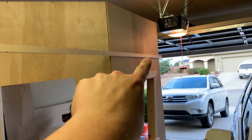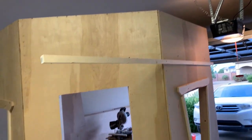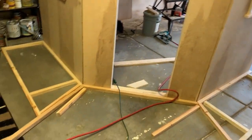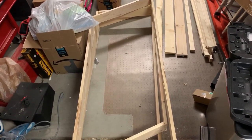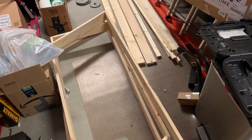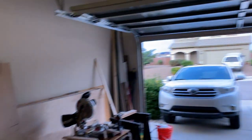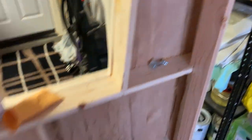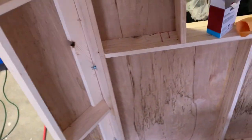So that's the height that the roof deck is going to be at. My second story actually starts here, and then in the middle it's going to be four feet up from there — so a total of 12 feet — but this is about six foot six right here, just tall enough for me to walk under, and most adults. Here are the sections of the second story roof deck or balcony deck that I've mocked up. I'm making everything modular, so you can see my bolt holes where they're going to go in, and on the back side I have bracing. I'm going to use a two and a half inch bolt, two big washers, and decided to use a wing nut so I can put these together by hand.